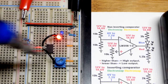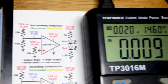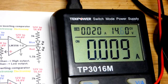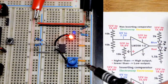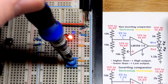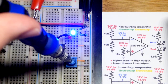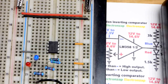Lithium iron phosphate 12-volt batteries have a nominal voltage of 12.8 volts; you can give them some extra voltage while charging to pack in as much charge as they can store. Now we've got about 9 milliamps of current — the amount of current goes up with higher voltage. The signal it's comparing is half of whatever the supply voltage is. Turn the trim pot above half, closer to the positive supply, and we have a high output; drop below half and we get a low output.